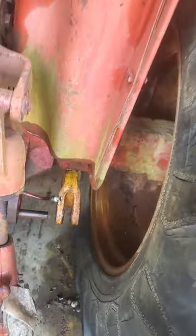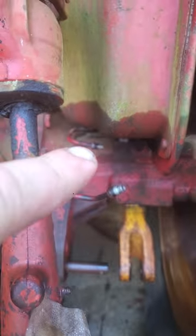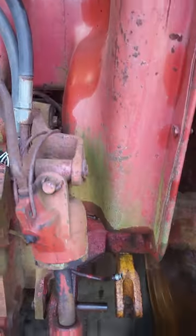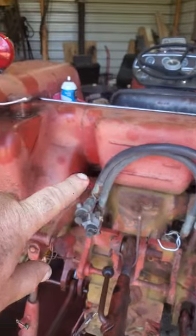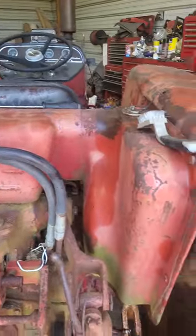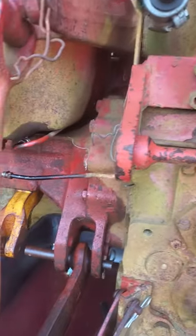These Internationals have got one heck of a system on them. You've got two lines right here — there's one hose, or one line, and there's the other metal line in the back. This tank on the back of these things is kind of a big saddle tank that goes across. So you've got fuel down on this side, then it crosses over to the other side. You've got a line here that goes right behind the top link piece, crossing over.